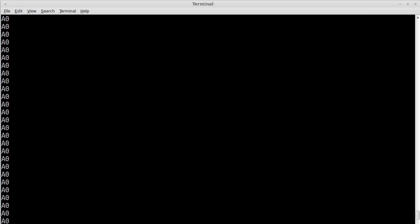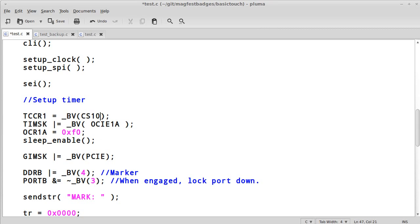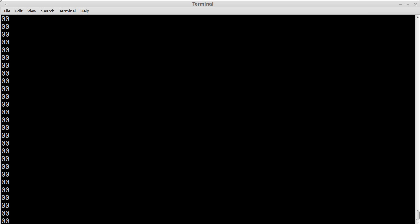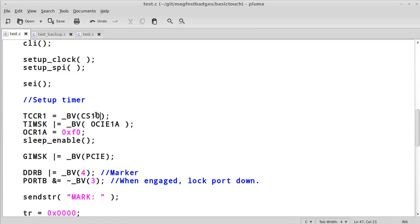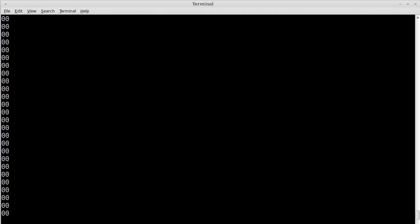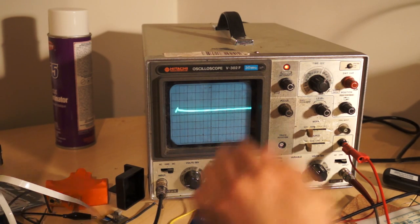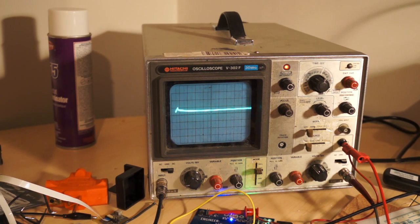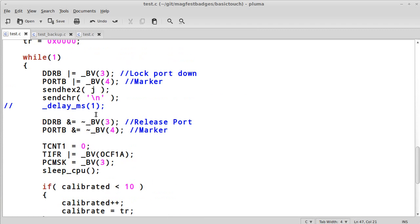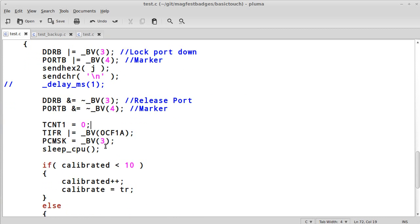So you can get this pretty detailed, but the problem is that you'll quickly run into no more room. You'll time out, because we only have an 8-bit timer here, before you actually get the data you're looking for. So right here, after trying to switch to 1, 0, or I guess it'd be 1, 1. Let's try that. Yeah, even with 1, 1, we still just don't have enough value. We can't go long enough in order to get any kind of good data. So yeah, this has been my little touch sensor thing here.